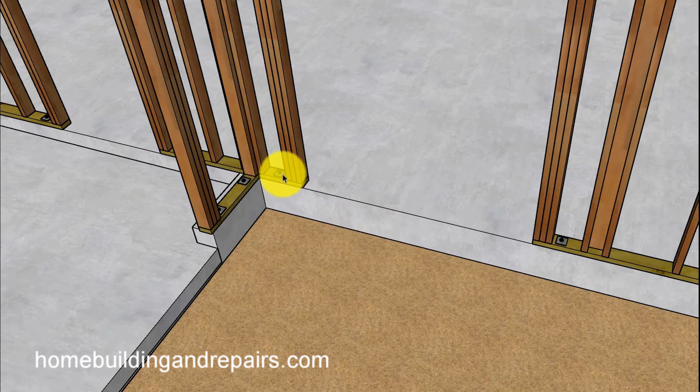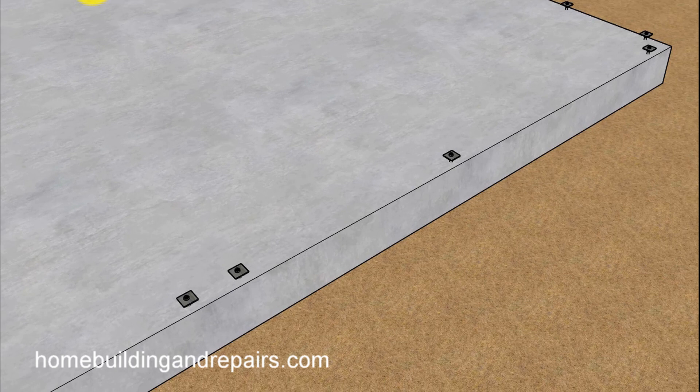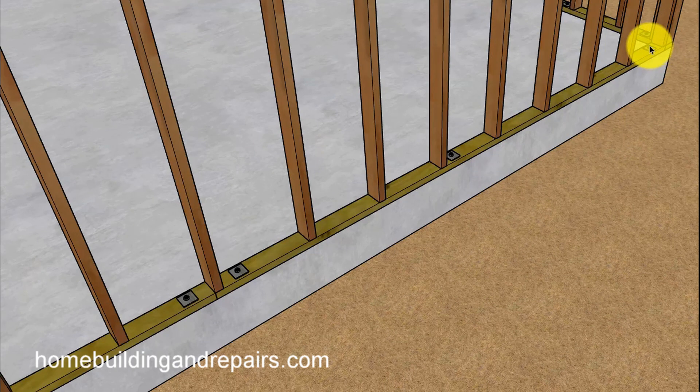A lot of building inspectors want to see the anchor bolts placed when you're setting the forms — they want to see where they're going to be located. That helps the framer. I've actually gone to projects where we were going to be doing the framing and I went and marked out where all the anchor bolts would go, just to reduce the problems encountered by us in the future. If you could just imagine a concrete guy putting one every six foot and missing a break — now we've got to come in and drill this and epoxy it.